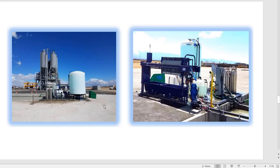One of the things that you can do is a filter press, and I know that most of you know what a filter press is. What a filter press does is it gets the cement in the water and dries it out really rapidly and makes these cakes that can be reused and crushed or hauled off easier. Whatever you want to do, it speeds up drying out cement water. And it gives you really clear water.